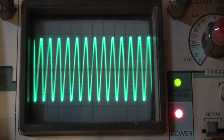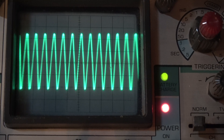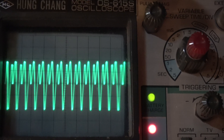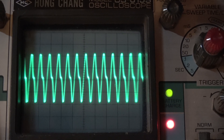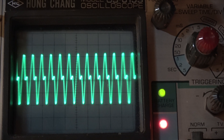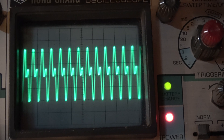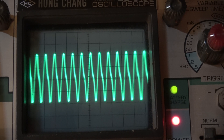I like to have a look at the actual raw output carrier wave — it's looking quite good there. But if you detune it or you've got your LC ratios wrong, it all goes distorted and you're getting a second harmonic almost as strong as the main signal. You may be getting good output or big antenna current, but a lot of it's coming out at the wrong frequency — harmonics which you'll have to filter out, or it's going to interfere up the dial. Often you look at a transmitter thinking it's working okay and the output looks like that — a second harmonic, probably third and fourth as well.